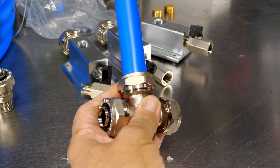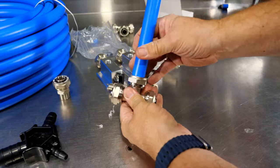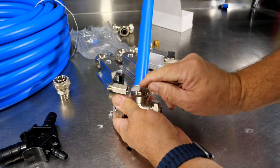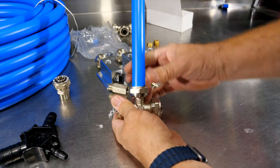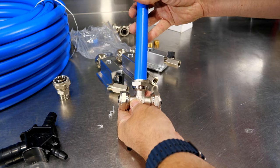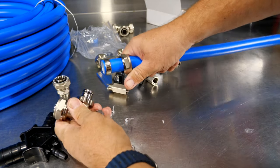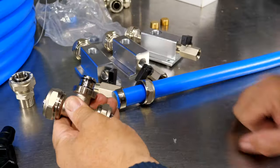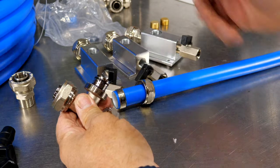then you're going to take your wrench, crescent wrench, channel locks, whatever, and you're going to give that 3/4 of a turn. So you can mark that with a marker if you want to. Come back later, give it 3/4 of a turn, or until it stops turning, and you should be good and sealed. You want to reuse it, unscrew it, pull it back off, and now you're ready to go again. And we even have some extra O-rings in here if for some reason they're damaged when you pull those off.